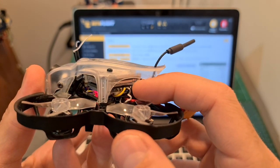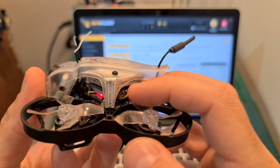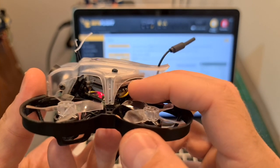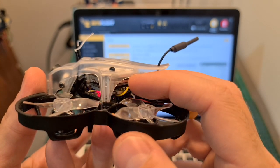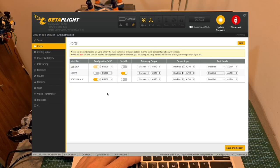When setting up the P16, you should keep in mind that its all-in-one flight controller features only one single full UART interface, and that's the reason soft serial must be enabled and some ports need to be remapped in order that the Caddx Vista and the radio receiver will work properly. All the settings are going to be pre-configured for you out of the box, but in case you're going to update the firmware of the flight controller, it is something that you need to keep in mind.